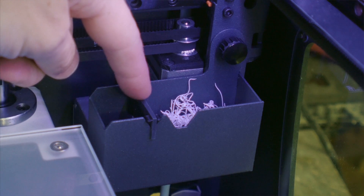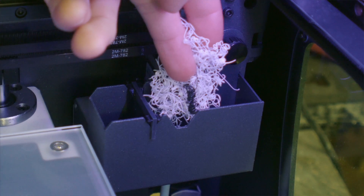The way it cleans off the hot ends as it switches is a bit of a problem, but not really a big deal and something I think they can improve with software. Anytime you want to finish squirting out material from one print head, you have to clean off the tip. On other dual extrusion printers, they wipe it on another area of the print bed. But here, they have a little hopper on each side with a rubber flap — when the hot end moves over it, it pushes off extra plastic. Then it purges what's inside into a little bucket. It wastes a huge amount of plastic every single time. With software, they could change how much is lost into that bucket. It doesn't seem like a hard problem to solve.